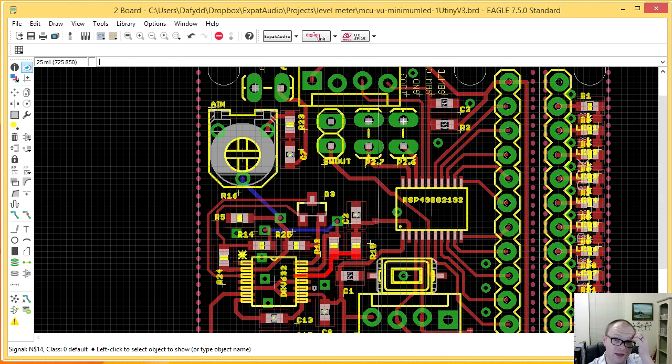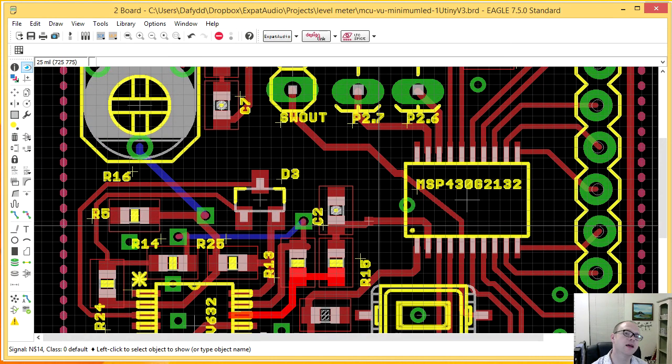Okay, so one of the things I can do at this point then is add a test point, an oscilloscope test point here, or put it into my test program where I tell the operator, hey, manually take the probe and put it down at this point. It's not ideal, and should I want to do a board in the future, one of the things I'll do here is put a real hole in the board, just like these vias. Add a via here so I can come underneath with a pogo pin. And one of the things I may want to do when I'm making this test board is put that pogo pin there and not populate it at this time, but say, okay, when I do get around to making version 3.1, adding that pogo pin, adding that via so a pogo pin can measure that voltage at that time.